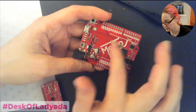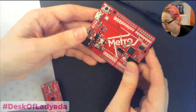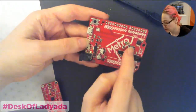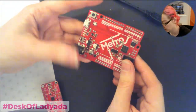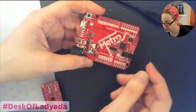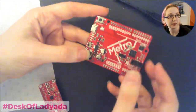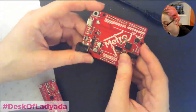We'll change the silk screen — right now it's a little bit cut up. We're going to redo it. It's probably going to be black, not red, but prototypes I like to get exotic. I've got a SAMD21 G18 processor here, same as the Arduino Zero, the Feather M0, but it's an Arduino shape with the same pinout as the Arduino Zero. It doesn't have a debug chip; instead it just uses native USB, which makes it a lot less expensive, maybe a little less powerful.